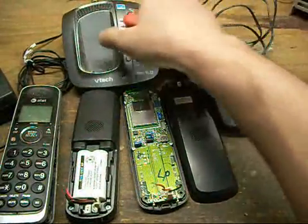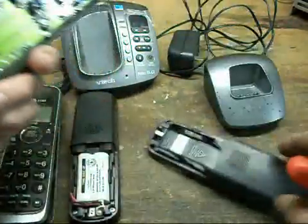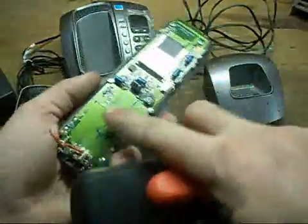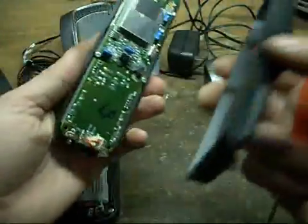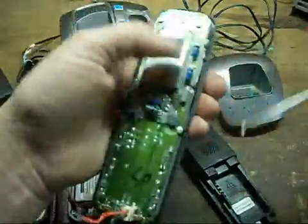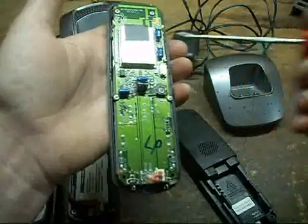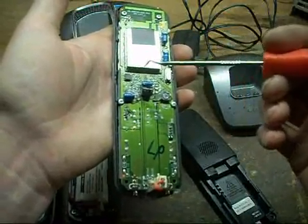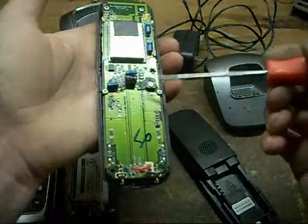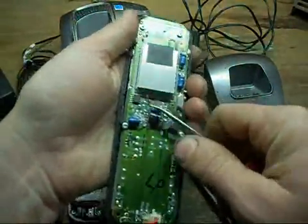Charging bases and main phone base. When you look at one before opening it up, the first thing you see is a couple of holes which expose a couple of test pads inside. When you open it up, you find there are several more test points, and pretty much a sparse circuit board except for a 24 series I2C EEPROM, a crystal, switching inductor, and power supply inductor — until you open up this little cover.